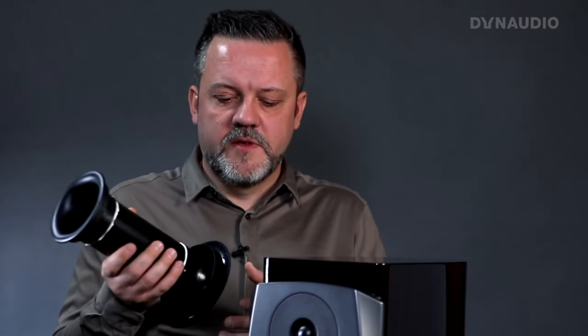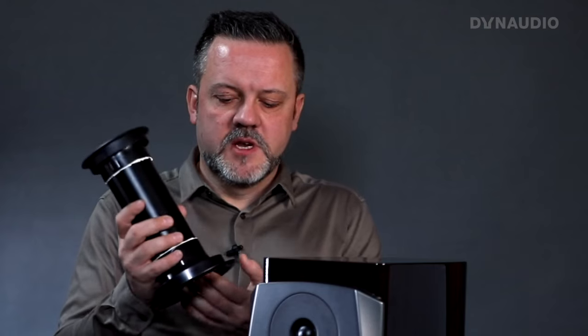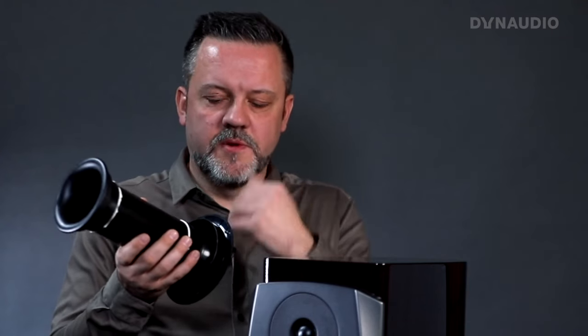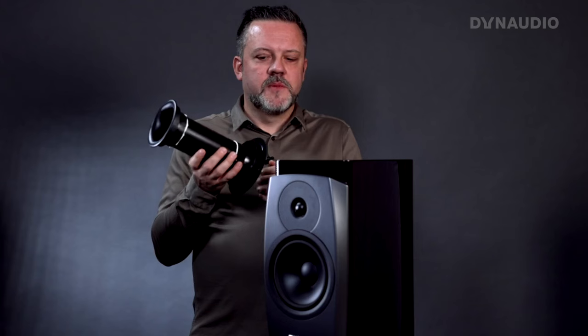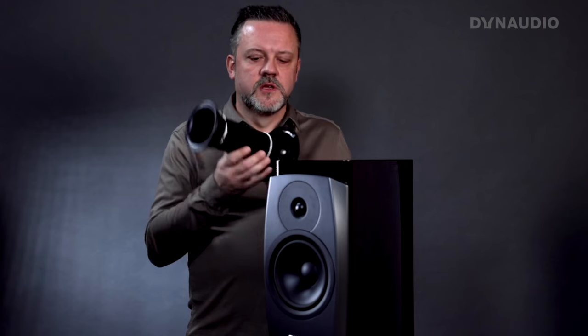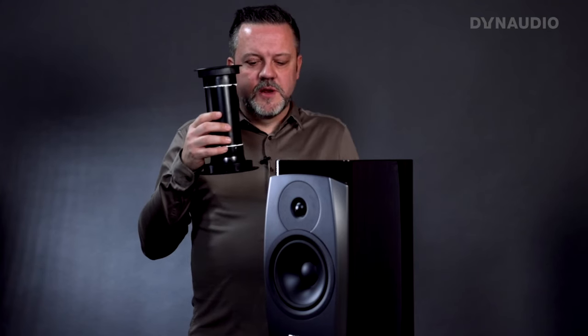This design has some other advantages as well. If you still have a slight amount of port noise, you might also have a bit of midrange from the speaker coming through the port that you don't want to hear. By directing it down, you don't hear that as much at the listening position. If it were pointing forward, you'd hear that very easily. If it pointed back, you'd hear it less, but it could still be reflected off the wall. So pointing it down gives you a cleaner sound.